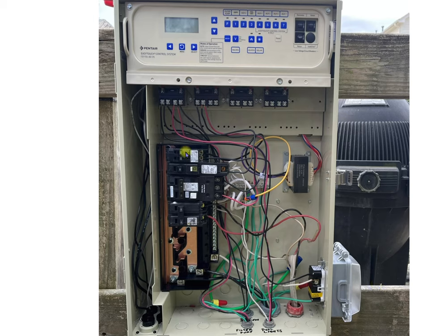The control panel is wired into the first breaker. The diagram on the control panel says the black goes to hot — so the black comes into here. If I'm using 120 volts, I take the violet and feed it into the neutral line. My yellow wire has a wire nut on it. Do not leave this wire nut off, because if that grounds out it will blow out the transformer and trip the circuit breaker — there is voltage going through this wire. Always wire nut it.